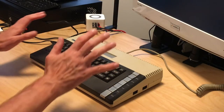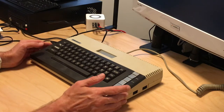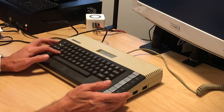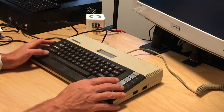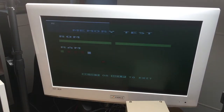A few weeks ago I did an unboxing of this Atari 800XL, sold on eBay as used. The Z key was broken off, just barely holding on. When I turned the machine on, I got a screen which at first looks okay, then turns from green to red — that obviously shows that the memory is faulty.